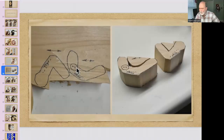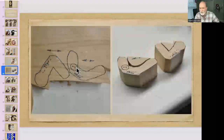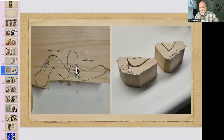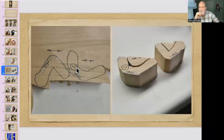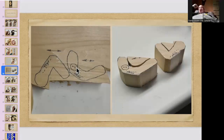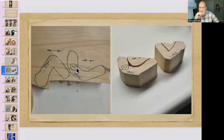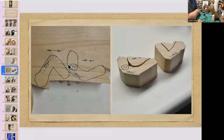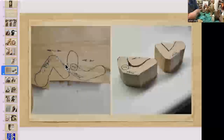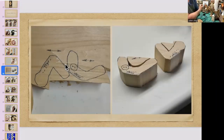I'm not an expert on glues by any chance, but I do know from my other hobby in radio control modeling, cyano is used a lot. It's very volatile. It flashes like mad, and it's just something you don't want to breathe. And so if you're soaking wood, I can picture using a lot of it. I wouldn't want to breathe that, unless I was outside putting it on and didn't go near it until it was hard. Yeah, that's why it's called cyanoacrylate, because that's cyanide. So you have to be careful with it, but it does seem to be working. The only problem with doing that is when you go to paint it, it's a hard surface. If you want to see the grain through the wood, you won't see it in that area. It'll be a hard finish.